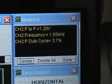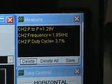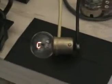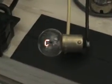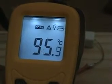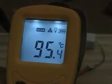I've changed the capacitor again at the 555, and we're now at 1.85 kilohertz — just under 2 kHz. We're still at 200 volts. Our bulb is exactly the same intensity — same amount of energy going in. The reason I put the tape on is because we only see micro changes here, but the magnet is slightly over the tape now. We're at approximately 96 degrees Celsius peak temperature at the resistor.